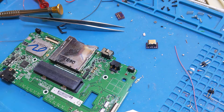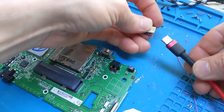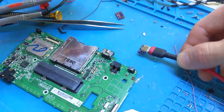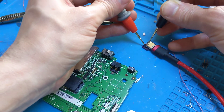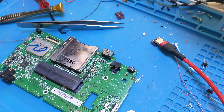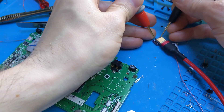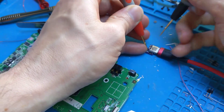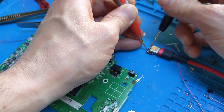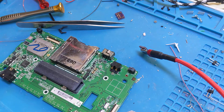We'll test it out with a multimeter. I've got this USB-C cable from a wall power bank and we're just going to test — are we getting power? Let me turn the multimeter to the right setting. Yep, five volts. And then I also flip it over to the other side — we're also getting five volts, so we know that all the pins are soldered correctly.